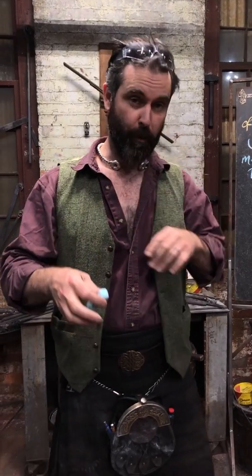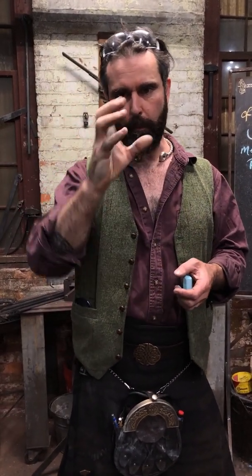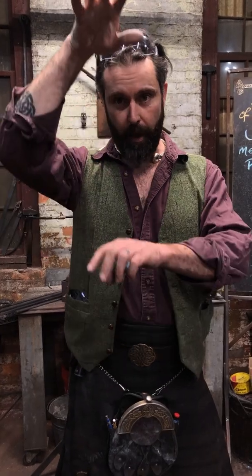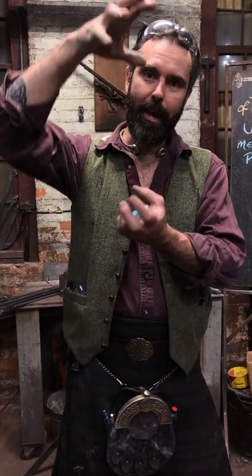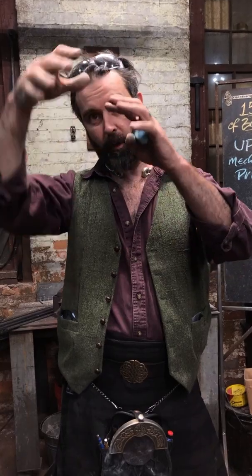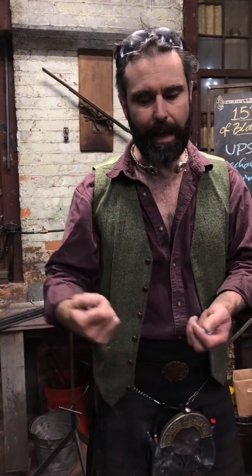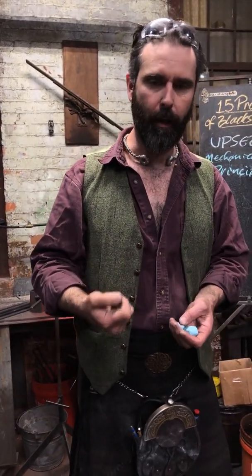If you go and watch a bunch of the videos of the folks out there working on power hammers, beautiful videos of like Farham doing hammers, he always comes in when he's trying to upset the material, breaks the corners on the top and bottom, and then starts driving. The reason being that he understands that if he doesn't, he can't center and control that material, right? You need to have a little bit of a dome there to be able to adjust it to get that energy to transfer in.